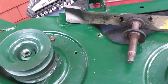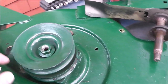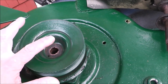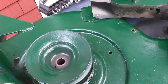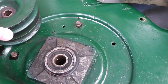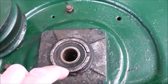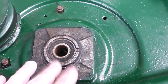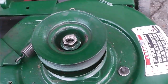Here's the project I was working on - I was going to replace the spindle bearings for the mower blades. Basically a straightforward project but it's turned into a cluster. The way you do it is you back off this nut, that'll leave an exposed shaft, you put the nut on by just a few threads, hit the top and the shaft will come out. That leaves you to remove your pulley, which exposes a bearing. There's an opposing one on the underside of the deck with the same number. You drive the bearings out, buy new bearings for three to five dollars a piece, put them in - quiets it right down.